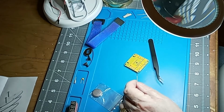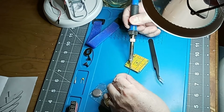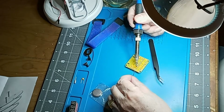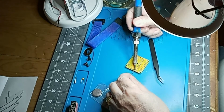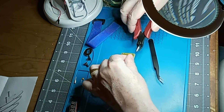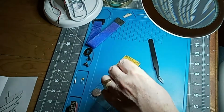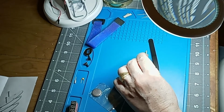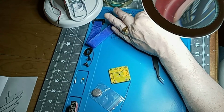And again, I'm going to turn on my fan. Sometimes the thing to do is to hold the soldering iron through the joint and count to 3, and then put the solder there. Turn off the fan. Snip, snip, snip. And I'm not letting these wires fly off into space. That one's a little long. I'm kind of piling them up here. Now they all stuck to my snipping pliers. What am I going to do here?